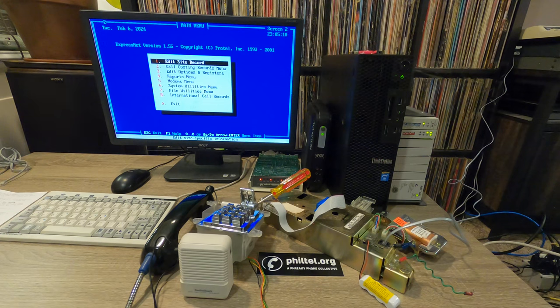So you might be wondering why I have this channel bank at all. It's really because when I first started trying to program the payphone with the modem, I was running into issues doing this with ATAs. ATAs would be the logical cheap choice to try because they're so inexpensive. But ATAs are notorious for having issues with timings and latency, and it just wasn't working. The connection between them would always fail. So I knew I needed something a little bit more robust than ATAs, so I was talking with Interlinked, and he recommended a channel bank, and I just so happened to have this one. I had a card, I just had to put it all together.